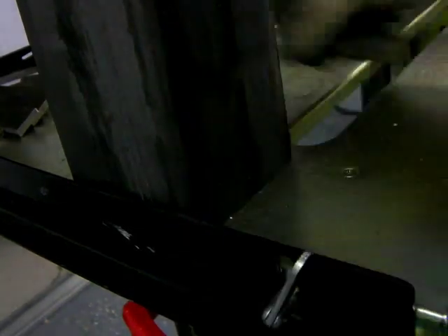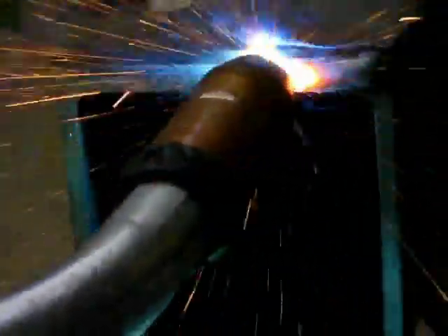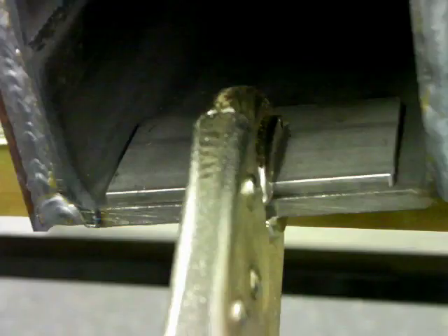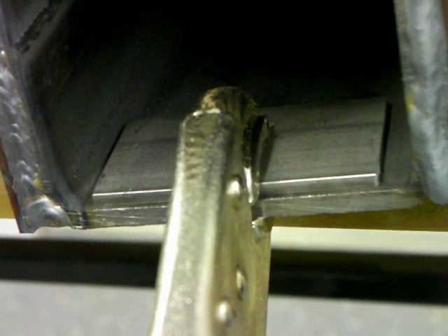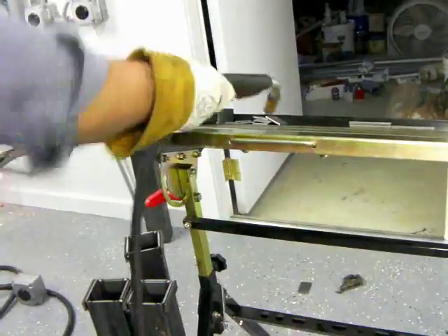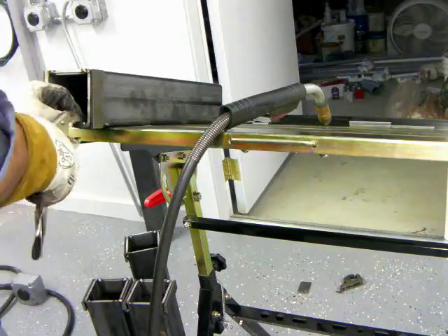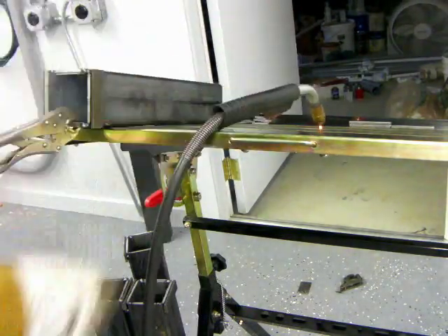The first thing we did was weld front flange bars on, and we used the Nomad portable welding table built by Stronghand because we weren't quite ready yet with the big one. The portable one sets up in a couple of seconds, and it had some handy features — mainly being able to tilt it up at just the right angle to weld down inside and get a good downhill run, because the weld size is kind of critical. If the weld's too lumpy or big, you have to grind it because there's stuff that goes inside. Being able to tilt the table was the handiest feature ever.